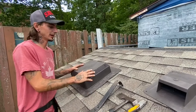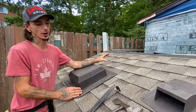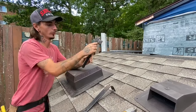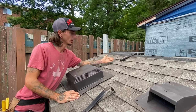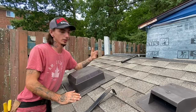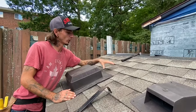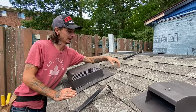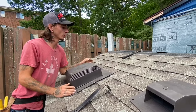When it comes to putting in your actual box vents, usually you're about a foot down from the top of the ridge. For most roofers, we kind of guess off our hammer. Most framers would measure it out, chalk their lines, and then cut their squares out. But for this instance, we're just going to go off the second and third row from the top, which is usually where it lands on your roof.